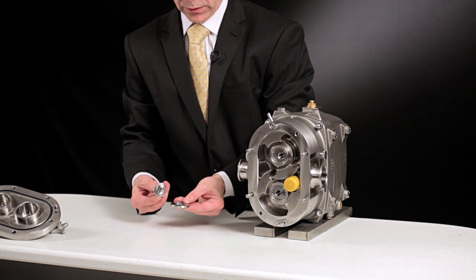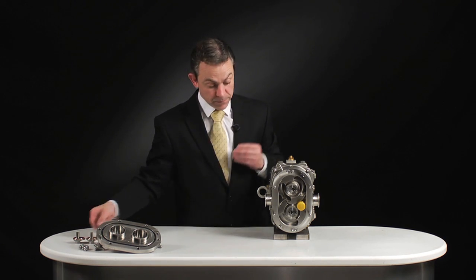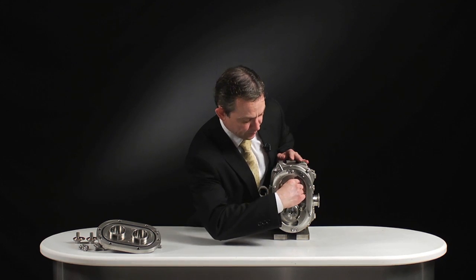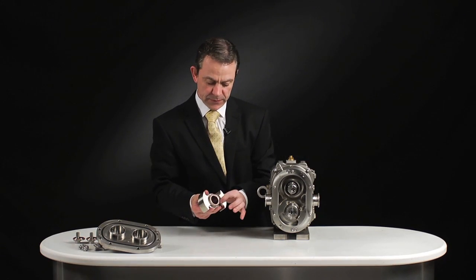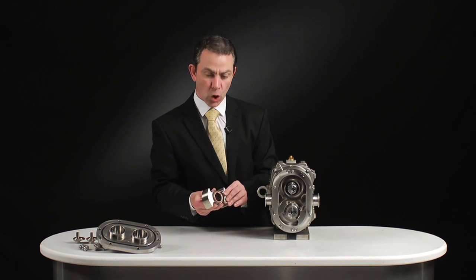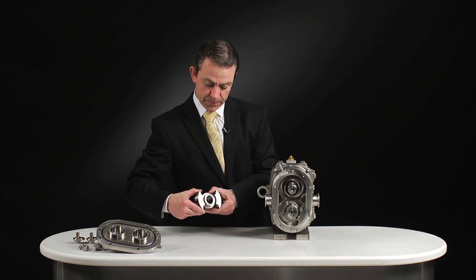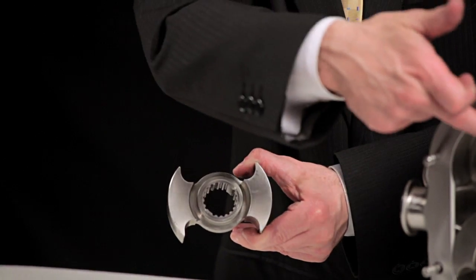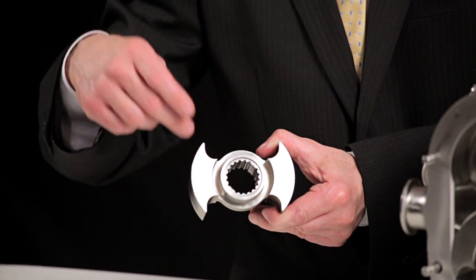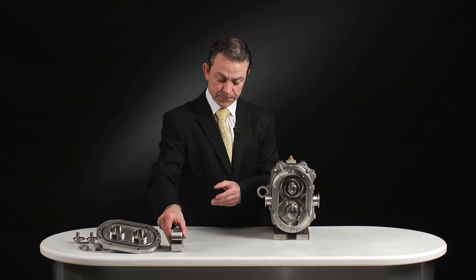You can easily see the rotor nut and its offset bolt. The rotors are very simple — they have a dog spline on the shaft and a dog spline on the rotor, so you can't physically get the position of the rotor wrong. They're also dotted: on the top rotor we have one dot which matches the shaft, so you can't put it in the wrong position. You don't need to mark top and bottom — you always get the rotor in the right place.